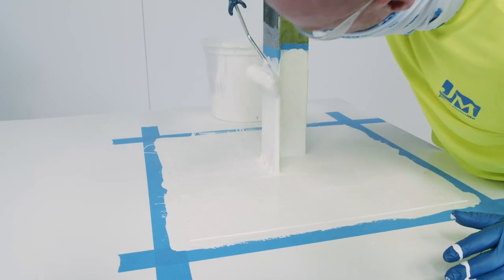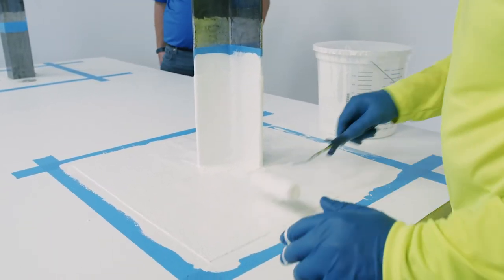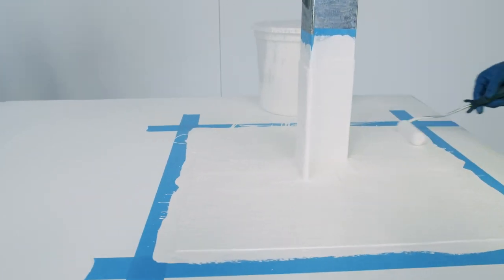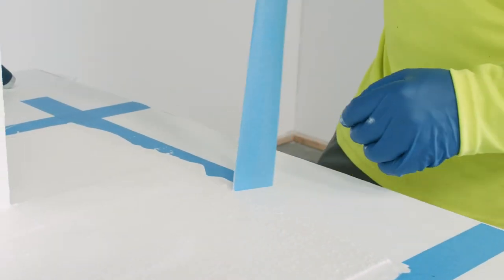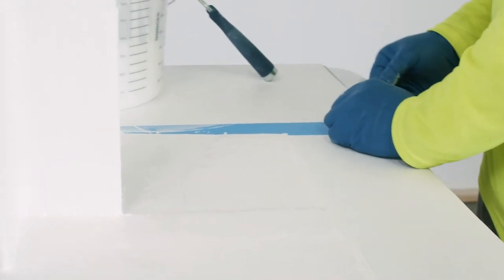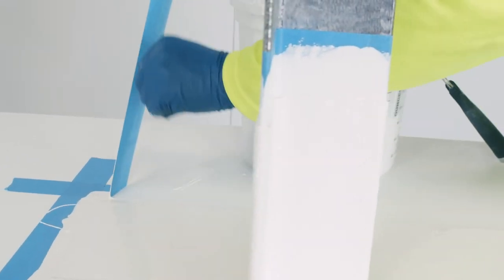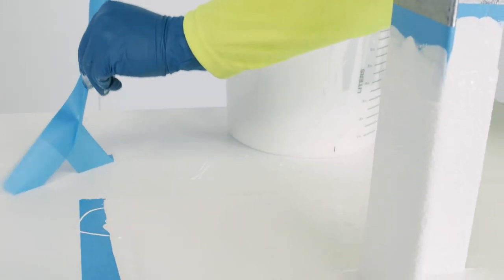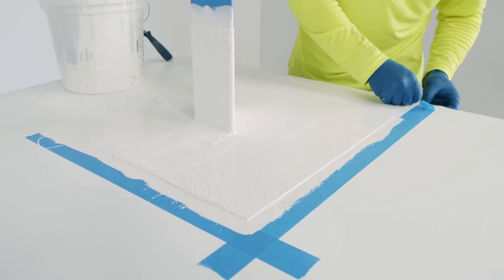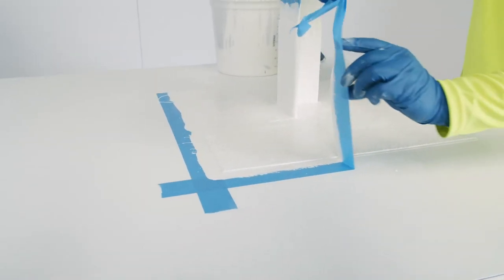Jonas is just finishing up with the resin. The last thing we want to do, while the resin is still wet, is start pulling this tape so we can get those nice clean square edges that really finish off the detail — pulling the tape all the way around the perimeter. Is this challenging to do later on? Yes, once that resin sets up it gets pretty stiff, so you don't want to be fighting stiff resin while trying to pull off masking tape. The tape really is giving nice clean edges, and you can see where we've got the quarter to half inch extending beyond the edge of the reinforcement.